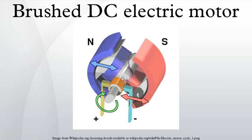These three-pole armatures also have the advantage that current from the brushes either flows through two coils in series or through just one coil. Starting with the current in an individual coil at half its nominal value, it rises to its nominal value and then falls to half this value. The sequence then continues with current in the reverse direction. This results in a closer stepwise approximation to the ideal sinusoidal coil current, producing a more even torque than the two-pole motor where the current in each coil is closer to a square wave. Since current changes are half those of a comparable two-pole motor, arcing of the brushes is consequently less.